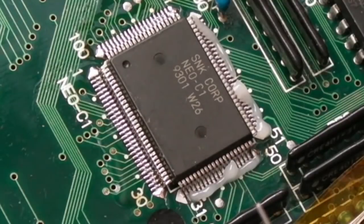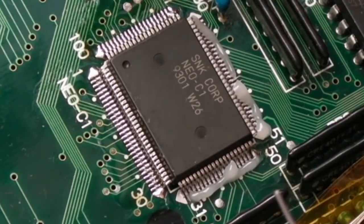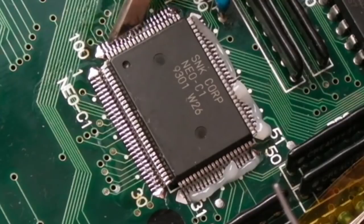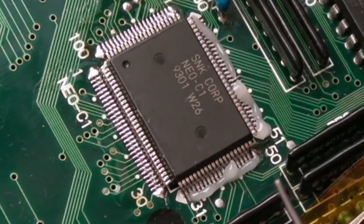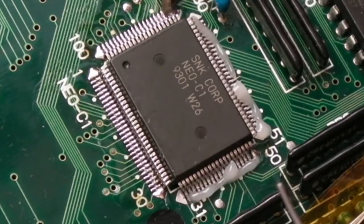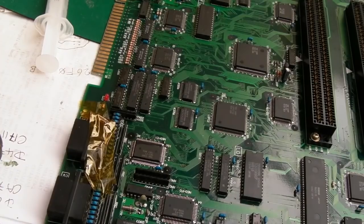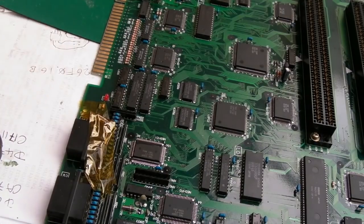We've got a bridge there, let's just get the solder off the tip. And I can't get in there because of that blooming resistor pack. There we go. So I haven't tried it yet. I did just reflow though with the Antex, because you know what, whilst the solder looks alright from the top, as you can see, just at the back, so between some of the pins, looked like maybe it had not balanced out properly.